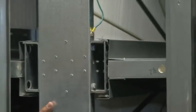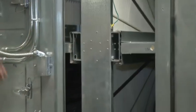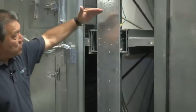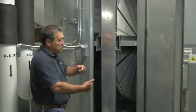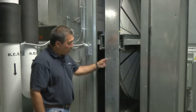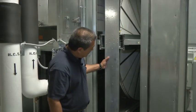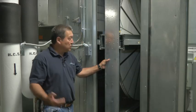The next part of this machine is the heat wheel, which is really unique. The return air passes through the wheel this way, the incoming air passes this way, and as the heat wheel turns it exchanges heat — heating or cooling depending. This heat wheel also does total heat and enthalpy; it handles humidity as well, pulling a certain amount of humidity out of the building.